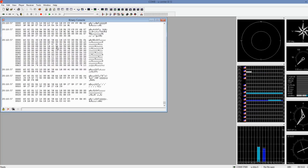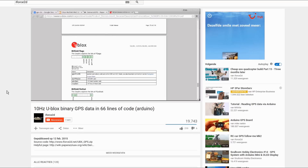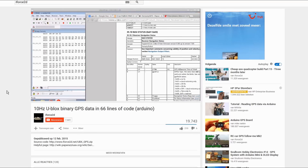At a certain point you will see a message on your uCenter screen that has structure in it. It's not very readable but uCenter accepts it as a valid data stream. If you have any GPS reception you might even see the clock start running. This is not NMEA data — DJI in this case uses the UBX data protocol. Chris from iForce2D did a great video on this UBX protocol; I will put a link in the description so you can learn more about it.